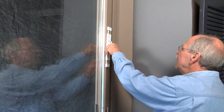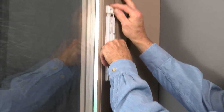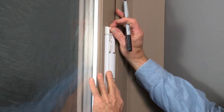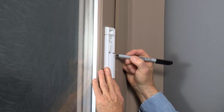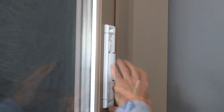Next, take the lock, align it with the latch, and then close both the bottom and top bolts. You'll notice there's a little wiggle room between the lock and the latch where they connect. Adjust it manually to make the space near the top and near the bottom about even. If you haven't done so already, remove the front cover faceplate on the lock.